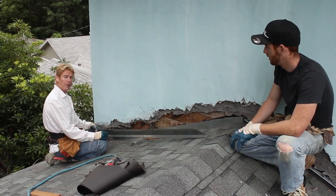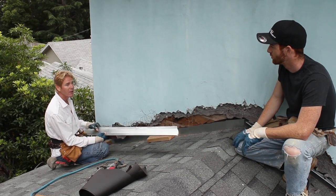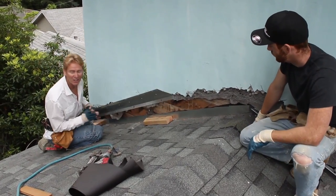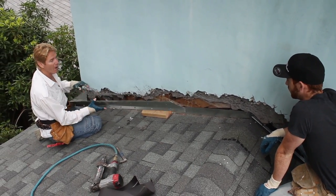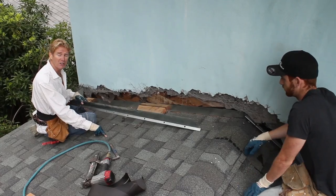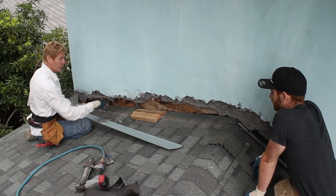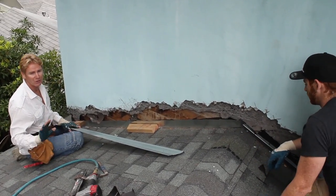Hi guys, Kirk J and Dan here with Kirk Giordano Plasters. Today I want to answer a question a lot of you folks call me about — I get about two to three a month — where folks say, 'They took the stucco right to the roof, right or wrong?' Wrong. I'll tell you why. This here is a weep screed, or a drip screed — same thing, same purpose. A typical 30-year roof is designed to last 30 years; stucco is designed to last a couple of centuries — it lasts forever. If you take the stucco down to the roof, I see that a lot, it's not completely wrong but it's not up to code and you don't want to do that.